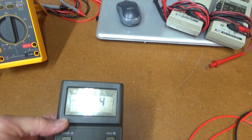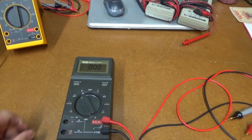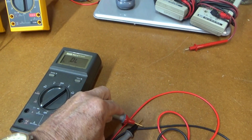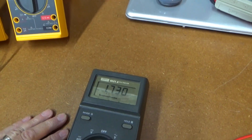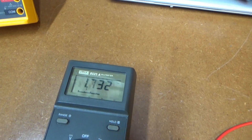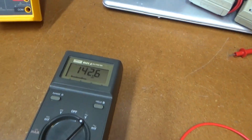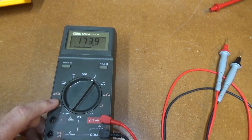That's a relatively easy fix. I think I had to do the same repair on this old 25 when I first got it. It looks like DC is working, all these settings are working, the continuity test is beeping. But on AC, it's already got a reading and it shouldn't because there's nothing connected. It's already reading something. Let's just try measuring 120 volts here — it measures 142. The AC side has an issue. DC side seems to be working properly, and the display segment is bad.